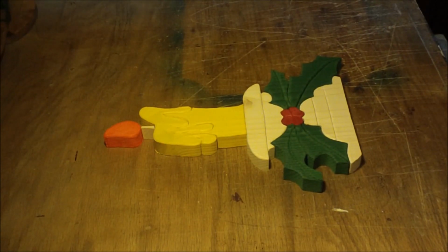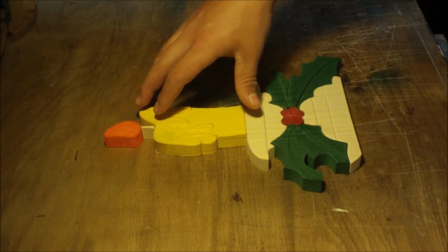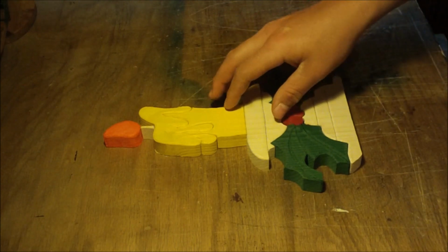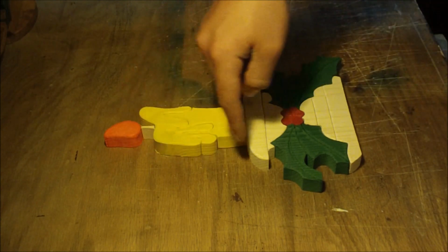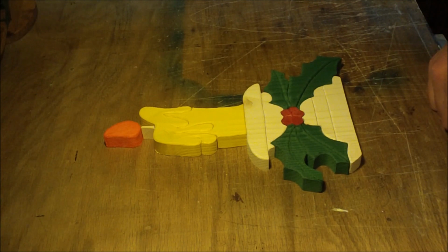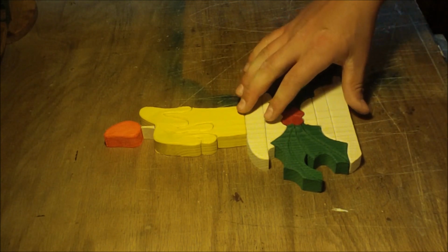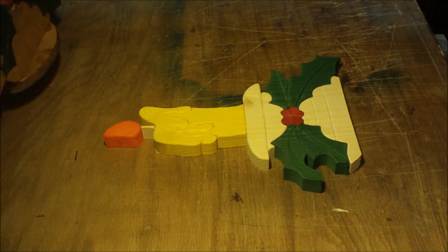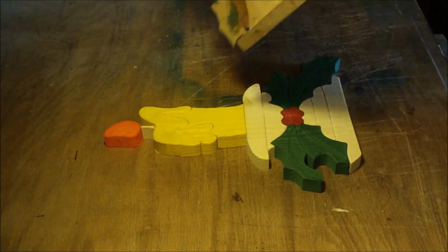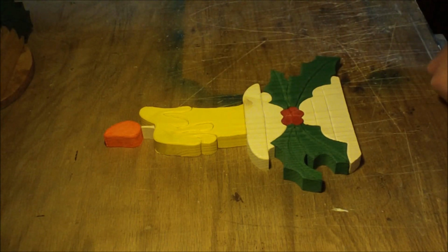So what I'm going to do, like any intarsia that you would do in any project, I'm going to put this on top of a piece of 1/16 or 1/8 inch plywood, Baltic birch, and trace around it, and then cut just to the inside of the line to have this glue on top of that, because if I just hang it up on the wall, then I want it to be all glued together like that, instead of like what he had, it all just shown on the back there. And to me that just looks a little bit not good, especially because he has it standing up and you see all that crap on the back of it.